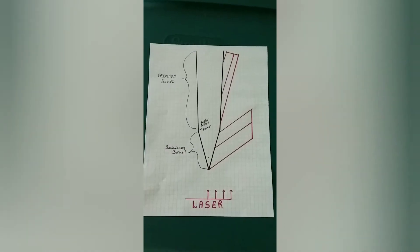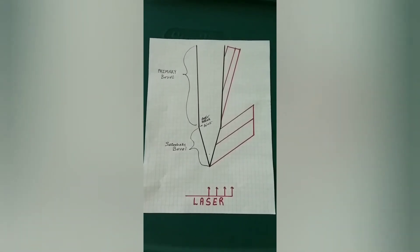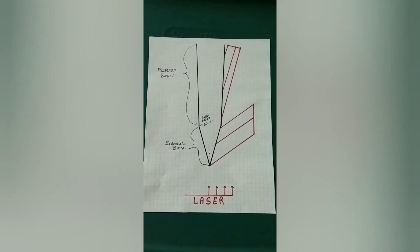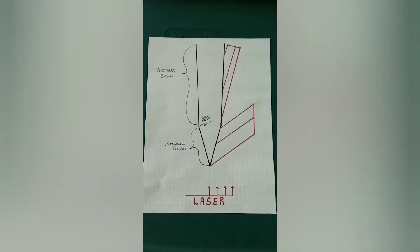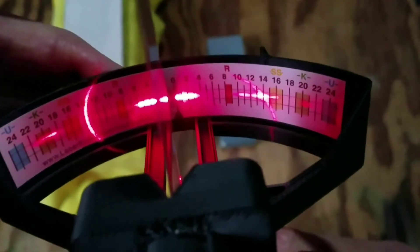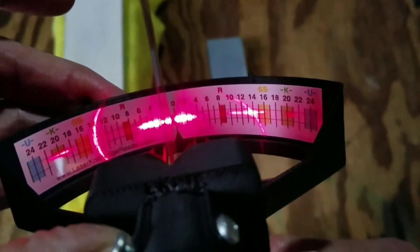The drawings provide an illustration of the previous reading. The blade is black and the laser reflection is red. The different characteristics of the blade are labeled and you can see the source of the distinct pattern created by each blade. This blade was initially sharpened like the first and I added a third bevel at the cutting edge.